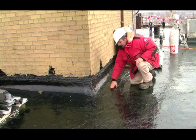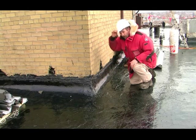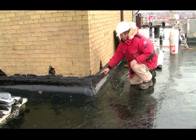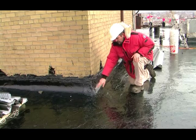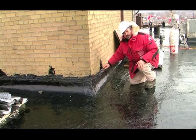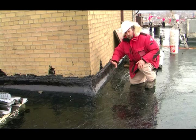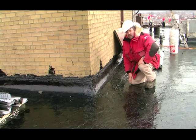The field goes up to the 90-degree angle, then we take two more plies of the flashing detail — either modified bitumen or the polyester — down with hot asphalt onto the roof system. We flood coat that at the end to make it seamless, then apply cold mastic around the top for water tightness, around all corners, and down seams. When the metal flashing goes on it's also caulked, so you actually have a triple seal: caulking on the flashing, cold mastic on top of the material, and hot asphalt right to the bricks.